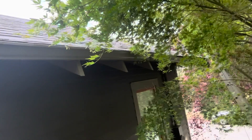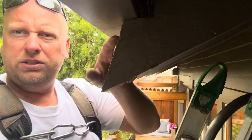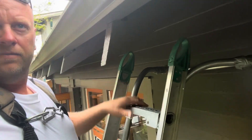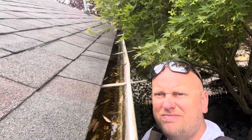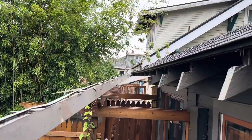It's sitting on these rafter tails. If you look on that side where the downspout is, you can see it's really high. What we need to do is notch these a little bit on that downspout side to make the water flow. We're going to take this piece by piece because we're trying to be really careful with all the flowers and brush below.